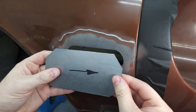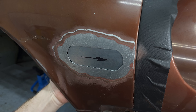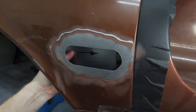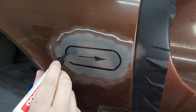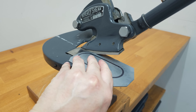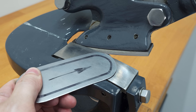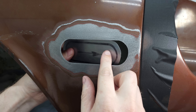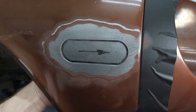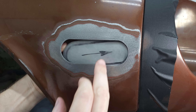I'm getting pretty close with the shape, but now the edges are touching the fender first and I can't get it any closer. So I'm going to mark the outline and cut it back. Just after cutting, the piece actually fits perfectly without any more hammering — it was just sitting on the edges and giving me wrong feedback. Now it sits flush on all edges, so I can scribe the outer contour and cut it to shape so it fits in the hole.